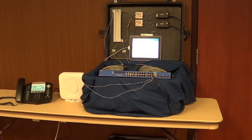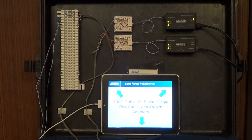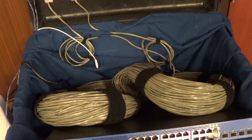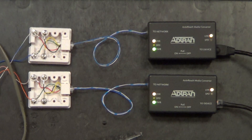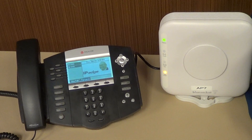In conclusion, what I've demonstrated today is the ability to take an ADTRAN NetVanta 1535P switch, connect it to cross-connect wire, run that to a 66 block, use bridge clips, connect a thousand feet of category 3 cable, connect back to voice-grade jacks with green and red wires and screw terminals, run another length of cross-connect wire to the ActiveReach media converters, and then with a standard patch cable connect up an IP phone and a wireless access point — and everything works just as it should.